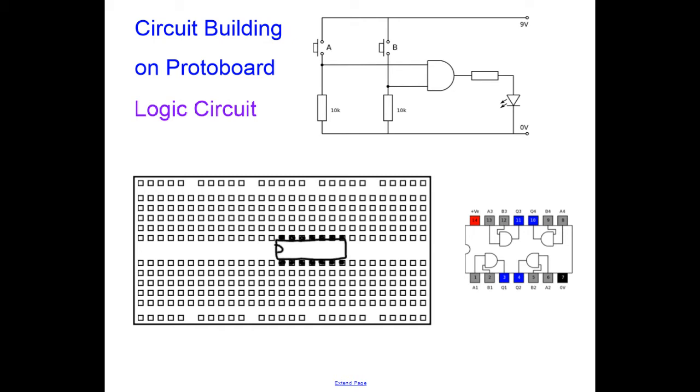Here are my 1, 2, 3, 4, 5, 6, 7 pins down one side and 7 pins down the other side. Always label the chips — an AND gate is a 4081 chip. I have my pin layouts next to me so I don't have to try and remember it or guess.